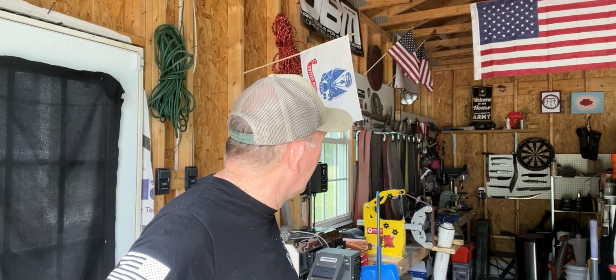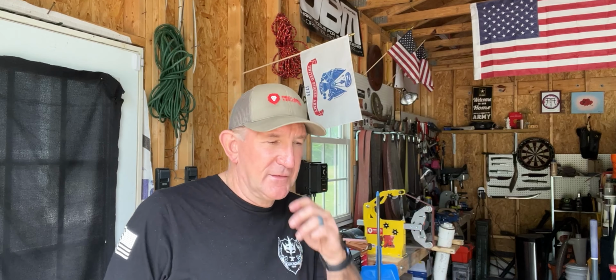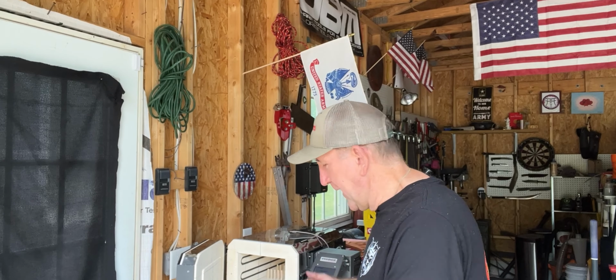So we did that. We then took our blades, the two dagger sets and the little scalpel knife. I'm just having trouble, I need some more sleep. We put some of the new scale on that, or no scale, so that we could put them in here and not have any scale buildup. We used the Even Heat Kiln to bring it up to 550, put the blades in, brought them up to full temp, let them sit soaking in the heat, then pulled them out when the cycle was done, and those are now air cooling, and we are moving along.